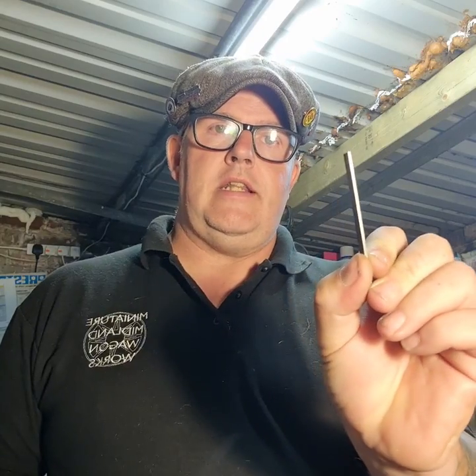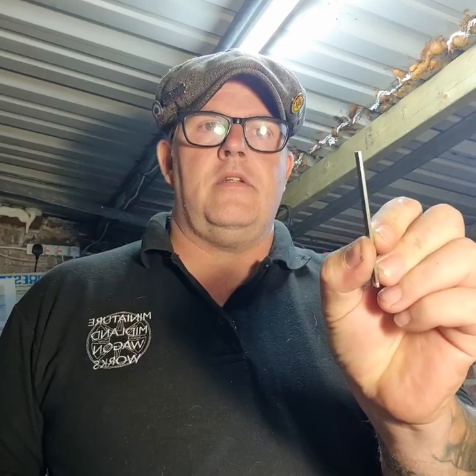What I'm doing at the minute is fabricating them. You start off with some quarter by sixteenth steel — you could probably do it a bit thinner, but I use sixteenth because quarter by sixteenth is available from loads of different model engineering suppliers. I am going to go down the route of having one laser cut because they only really need to be a millimeter thick, not 1.6 as this would turn out to be.